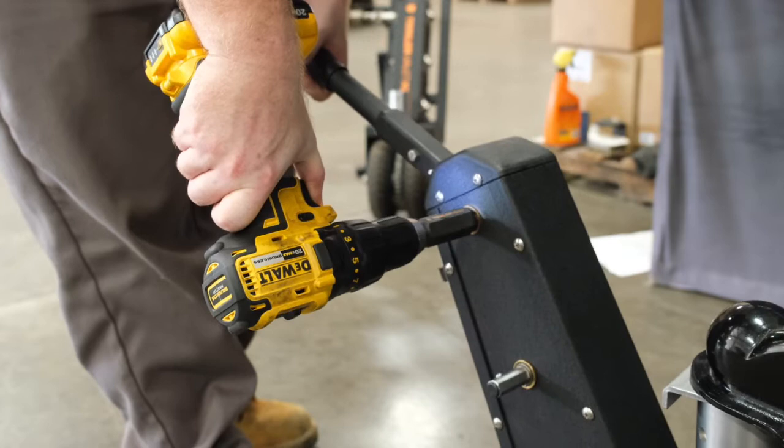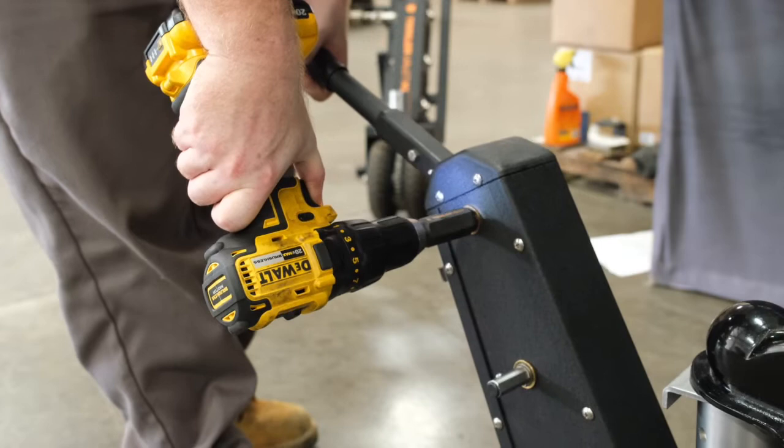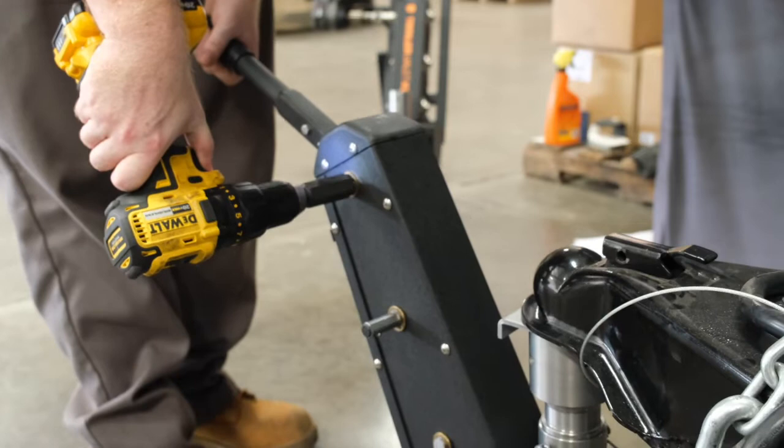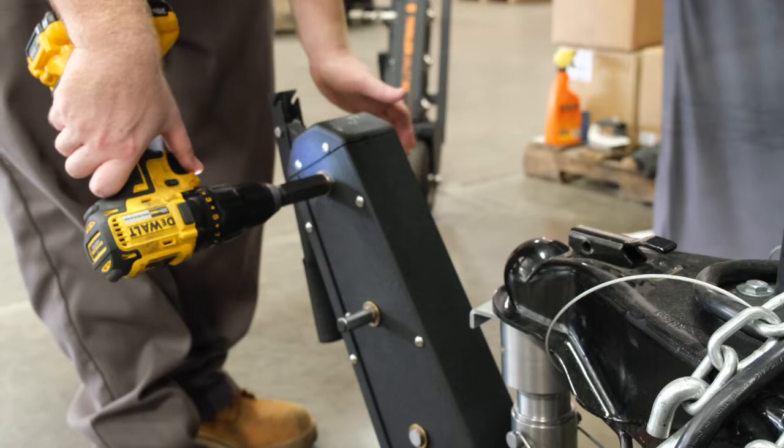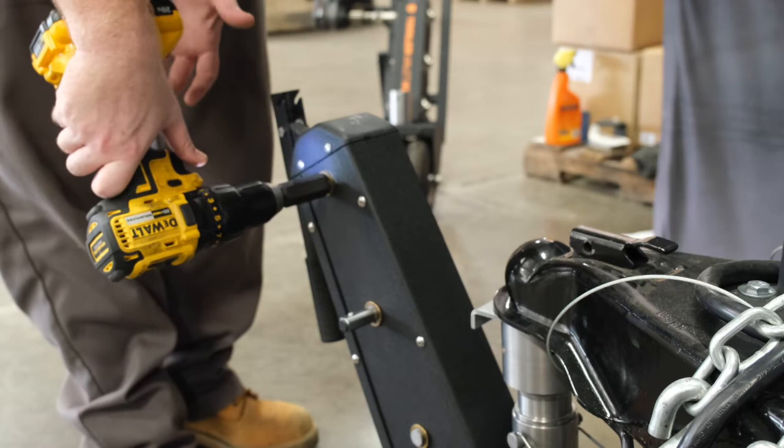As you get comfortable with the drill, you can slowly increase. Do not gun the drill, which will cause it to kick back on you. If you are lifting or dropping your brake handle at all, it will kick back on you. Keep in mind, I do not recommend using the drill on any type of steep incline or incline of any sort — you lose control and stability of the unit when using the drill attachment.